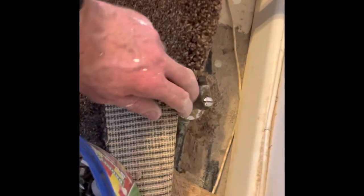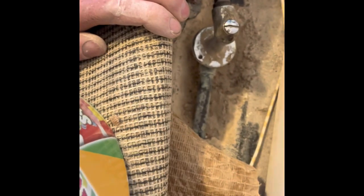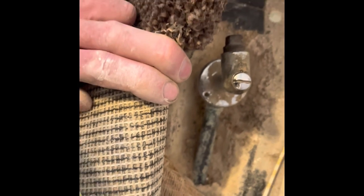This is where that gas pipe was sticking out of the lounge floor, so I've just spent the last half hour or so chipping it out with a chisel. I was too scared to put the hammer drill on it, but I've dug just enough around that gas pipe so my plumber can cap it off under the ground. Then I'll just pop a bit of cement over the top of it and relay this carpet, just to get rid of this knobbly bit sticking out.